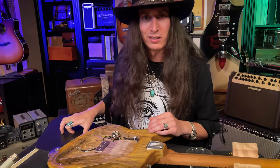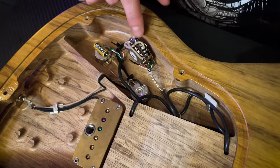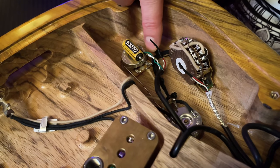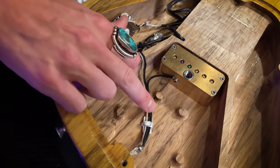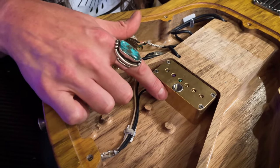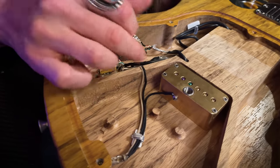While we're back here, let's admire the wiring — there's some pretty fancy stuff going on. We've got a couple of grooves coming from the pickups going to this toggle switch, which is a pretty impressive toggle switch. That's some really clean wiring that looks like it's going to last the test of time. You can tell they know what they're doing — it's really organized. They've even got zip ties tying some of these wires together. The output jack wires are clamped down so they're not going to get loose from jumping around with the guitar. And that's a really secure ground — grounded to the brass plate right here. I hate when guitars lose their ground, and a lot of times it's because guitar companies don't secure the ground wires. This is really well done and built like a tank.